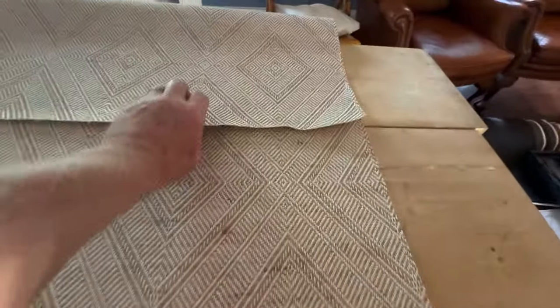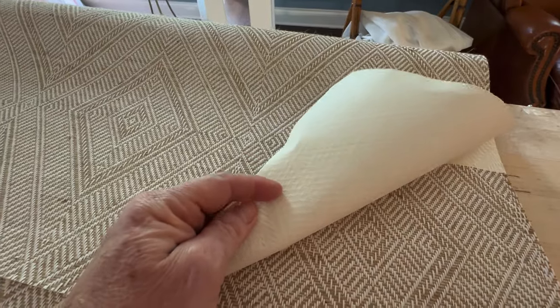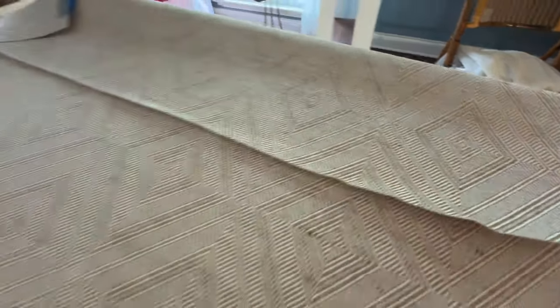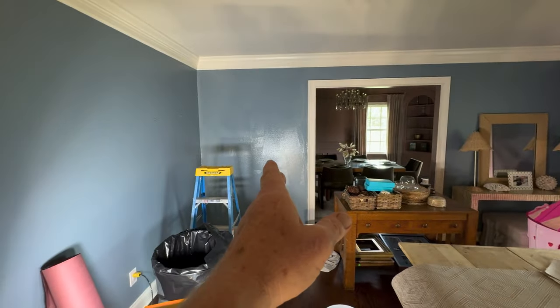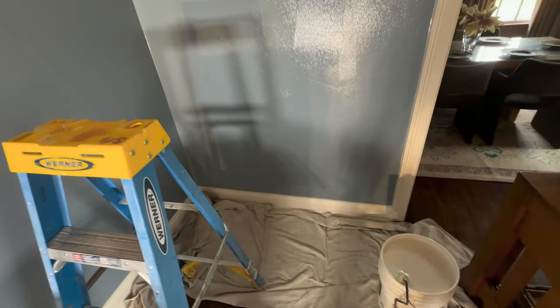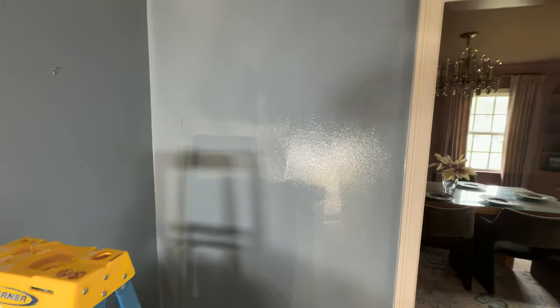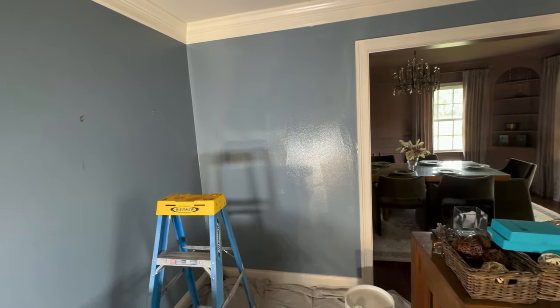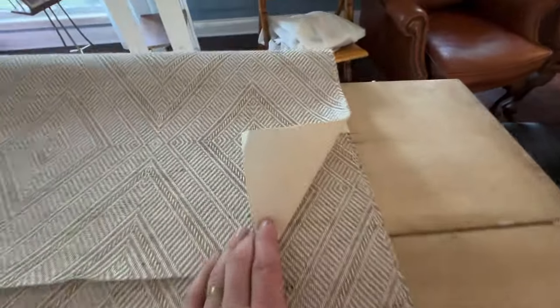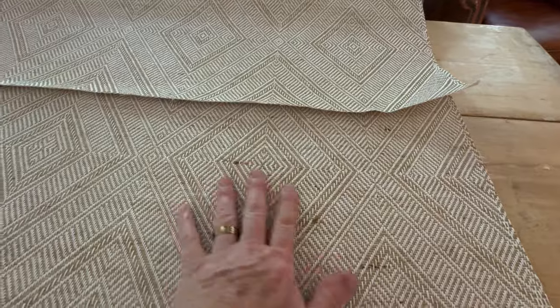Now the backing is a very porous, very fine backing. I've decided to dry hang the product because I'm going to trim it on the wall — I have no other choice. My wall is pasted with a very dry paste; its water content is low — it's not 880 and it's not 838. Here's why: if you wet this too much, the stain of the paste could come through and make marks on the wall covering.